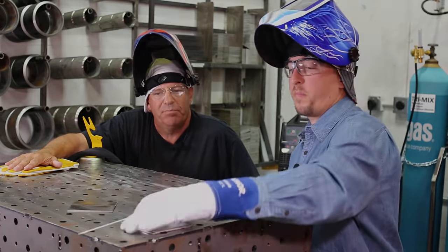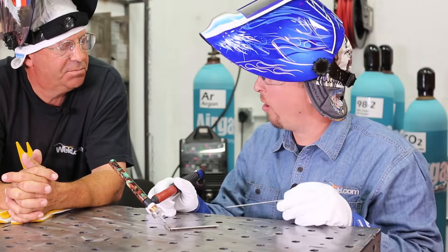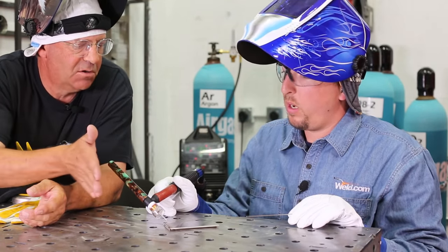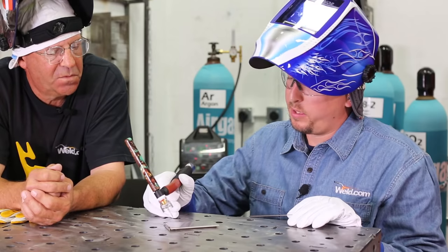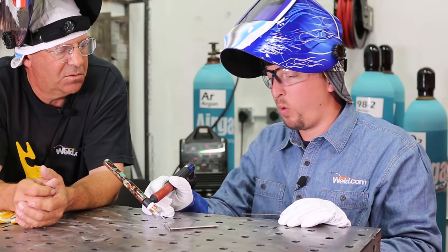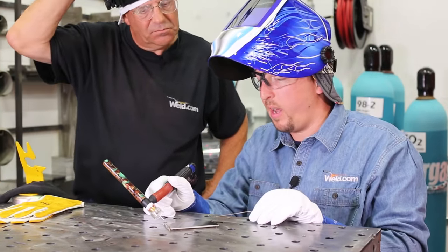We've got a lap joint here. I'll be pushing a little more filler into the puddle to build it up. We should get a little better color, a little more puddle definition. Change your torch angle a little bit — steeper, about 45 degrees. I was running pretty well straight up and down on the last one. So this one I'll be pushing into the puddle as I move down the piece, which will create more gas flow. We should see a little more color and a little extra filler wire for more definition in the resulting puddle.